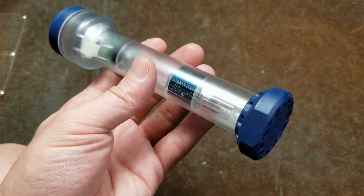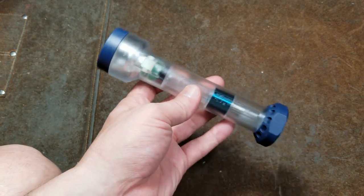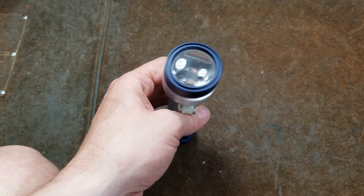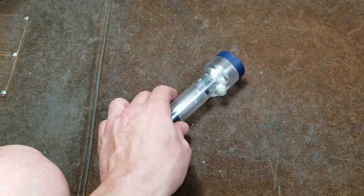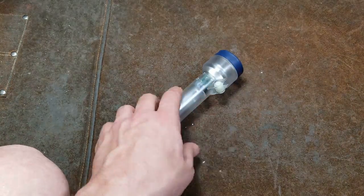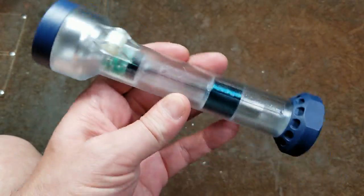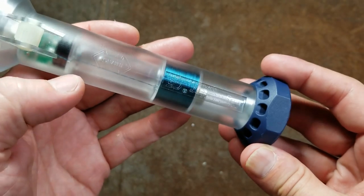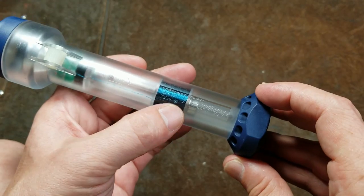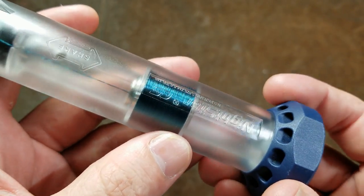The problem with these lights is they don't really work. If they've been dead for a while, you have to shake it for minutes and minutes to get the capacitor to prime. There's almost no light output compared to any modern flashlight. A lot of people like the idea of a flashlight you can shake and charge, and they are pretty neat because they have two additional rare earth magnets at each end so the large one can bounce back and forth.